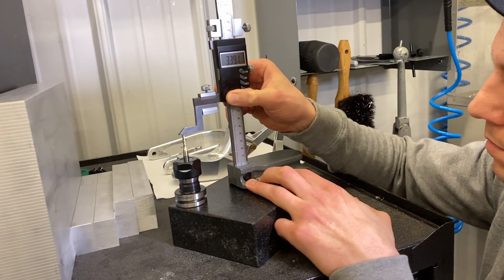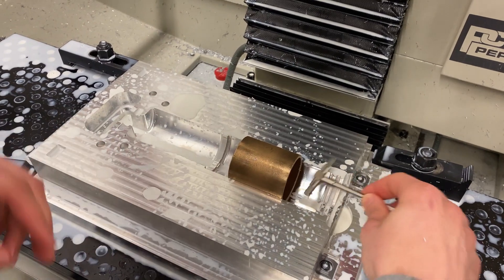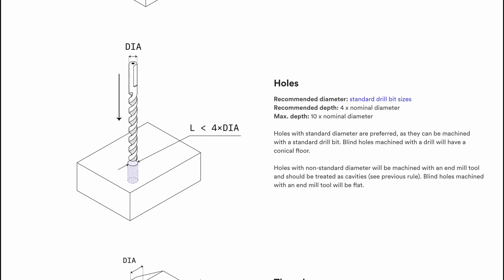Check the quality of your tools — make sure they're sharp, have no run out, and that the equipment you're using to measure them is calibrated. If your measurement equipment hasn't been calibrated in a while, you won't have a good way to confirm if your tooling is dialed in. Another thing that makes machining a lot easier is design for manufacturing — if you're in an environment where you can both design and machine the part, it helps a lot in simplifying the process. If that's new to you, there are good guides online on how to design for machining and I'll leave a link in the description.